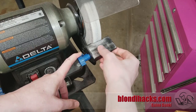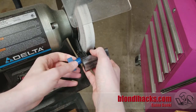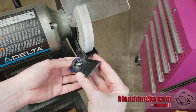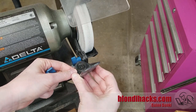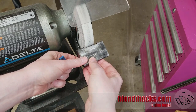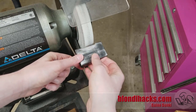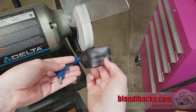I've actually worn most of the powder coat off from grinding tool bits on it, so it does sort of work. The other big problem is the angle-adjustable part, which has this toothed wheel mechanism. The teeth are really coarse, so if I want to set it at 10 degrees — to grind the back rake on a tool bit for steel, for example — I can't, because the increments are too large. You end up either square or way off, and you can't do nice fine adjustments.